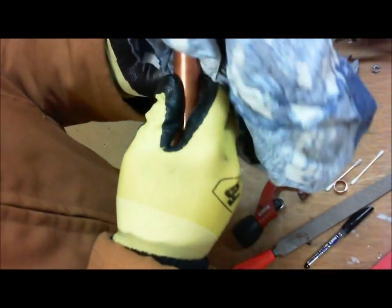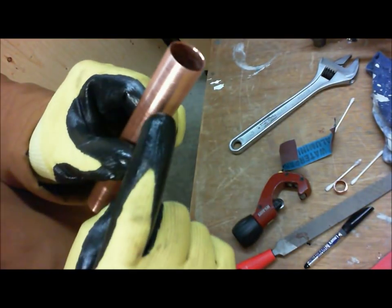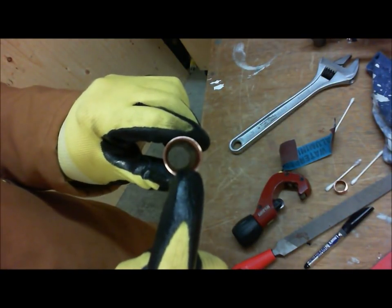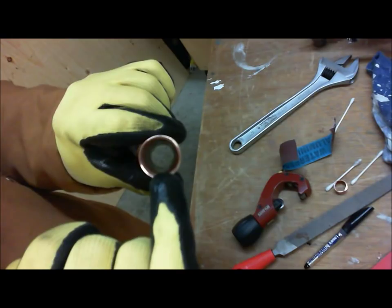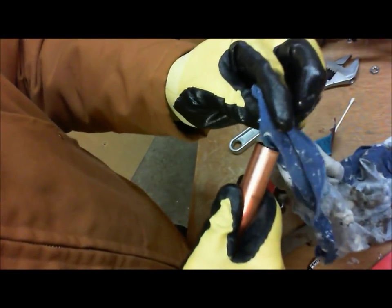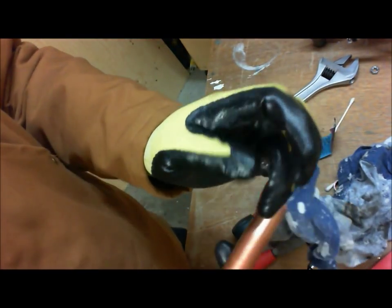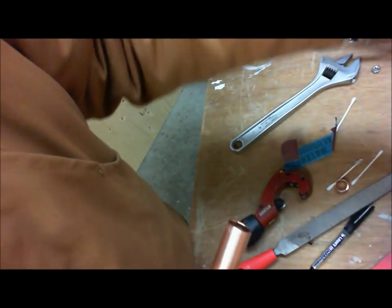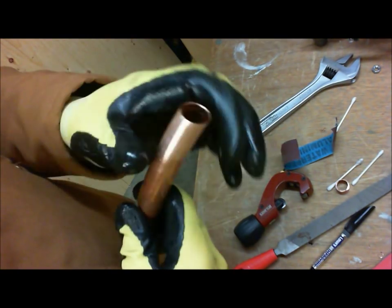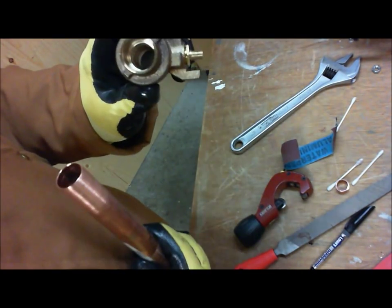Take the tube or the pipe there and just kind of wipe it, all right? So now we've got a clean surface on the exterior. We've got a clean deburred pipe on the inside. And if you want, there's a bit of crud inside there now too. Take the pipe here and clean it out, baby finger or some kind of Q-tip, whatever. Just get as much of that stuff out of there, because when you're going to solder and put the water on, any crud that's left in there is going to travel through the plumbing system. So the more you can get rid of now, the better, okay? So we've cleaned it, and here's our prepared socket.